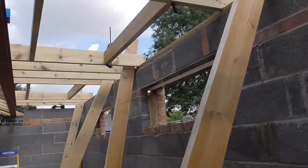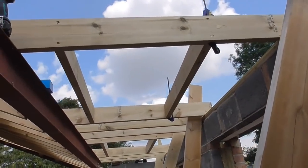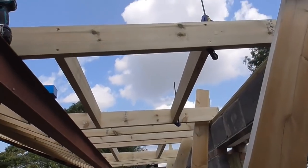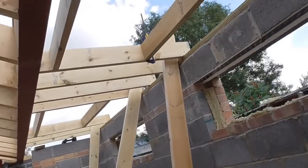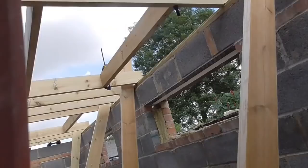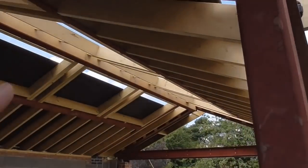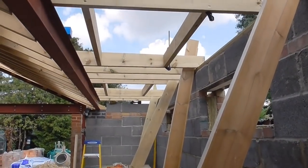You can see what I've done — I've fitted those trimmers. They're supposed to go onto a double joist to support the roof that's been cut out for the skylight, but what I've done is left it out so that I can screw straight through the end into the trimmer. I've actually screwed it with some big 6x100 screws because I'm struggling to control the cupping — as I mentioned in the previous video, this treated timber is really starting to move around. Hoping that screwing it might help control it a bit. I can now put the other rafters back in to make them back up to doubles, and I might have to put metalwork on — I'll check the structural drawings. I think it was just a single trimmer on a double rafter, so I'll get those bashed in now and take a break from this sun.